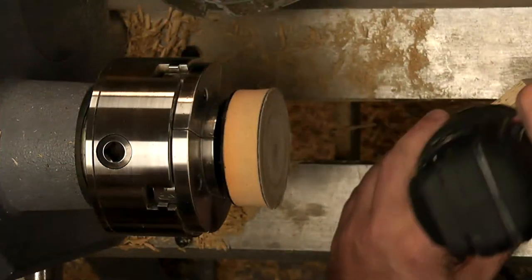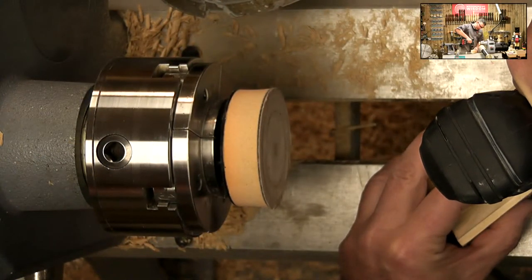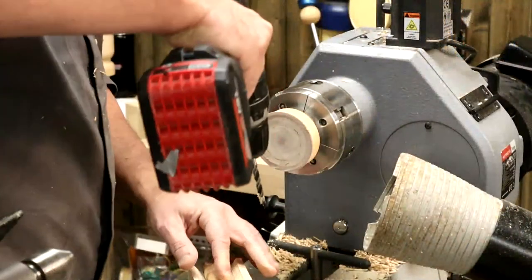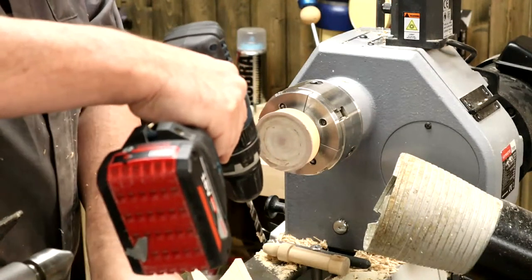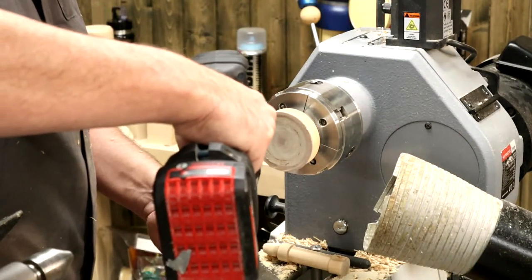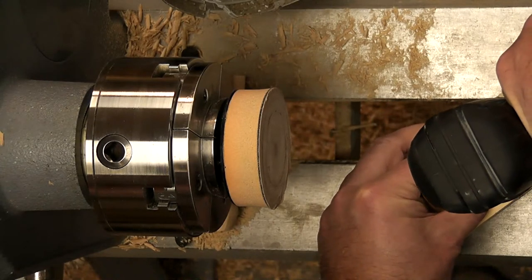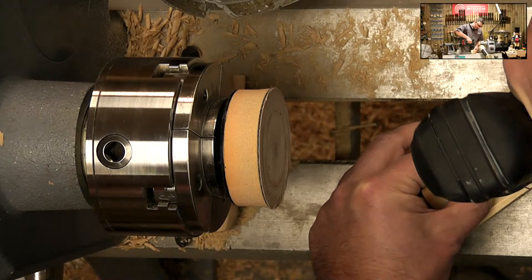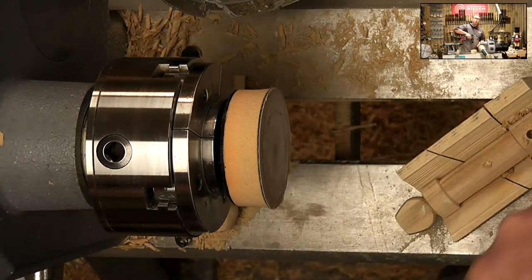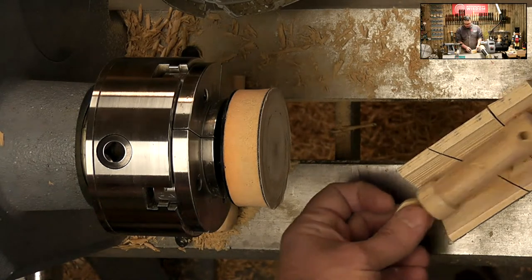Right, so I'm just going to drill this, not my chosen way of drilling, but keeping my hands well out of the way. And the other reason, of course, that I want to use a pillar drill is because it's upright. It keeps everything accurate for me, where unfortunately my body's got far too many moving parts on it, and can never drill very accurately. And I also don't have a built-in depth stop. That's always a concern when you're doing things like this, where your pillar drills will.